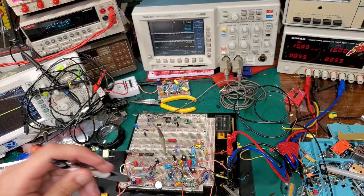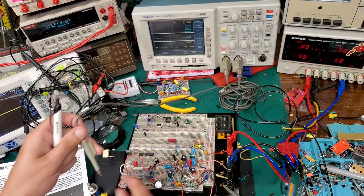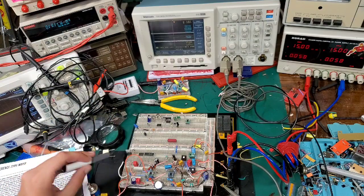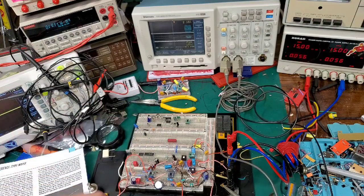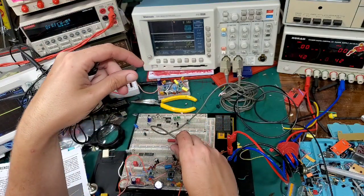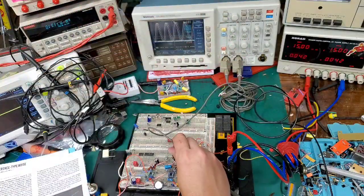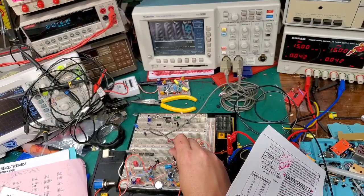Anyways, I got rid of the big potentiometers and their flying leads because of those spikes that get superimposed during the switch of the triangle. And I went to little tiny pots. Instead of having the switching circuitry over here, I moved it up to the second row of the breadboard. Didn't help. So, trying something else, I was just poking around to try to find signals, and I ended up finding a bigger and better sine wave from the opposite collector. Why he doesn't use that collector of the 394, I don't know.